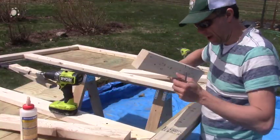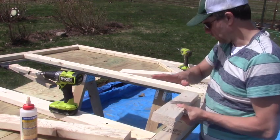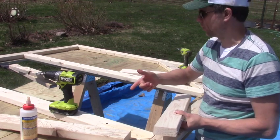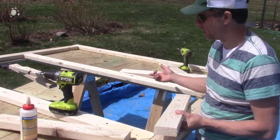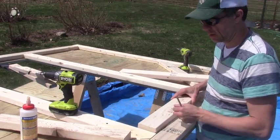And then we're just going to put the header on the door right here. And the exact measurements of these cuts of wood would depend on the size of your door. So if you want to design a different door than I have here, you would just change the length of these, etc.